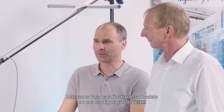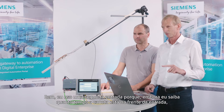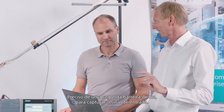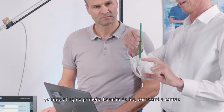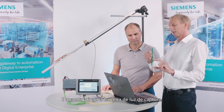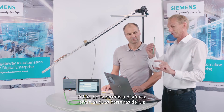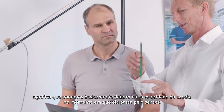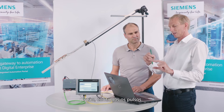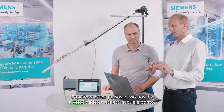But to illustrate this model on the test setup, I use a second input. While I know how long the pen is in front of the input, I still have no measurement of speed and no length at all. I need a second light barrier — that's the capture input signal. When the pen reaches the first light barrier, it will begin counting, and when it reaches the capture light barrier, the counted value will be copied into the current count value of the capture input. Knowing the distance between the two light barriers means we can basically determine the speed of the pen as it falls past the sensor.